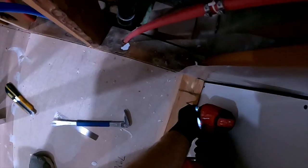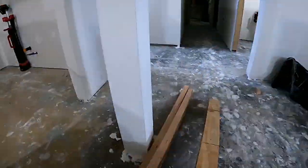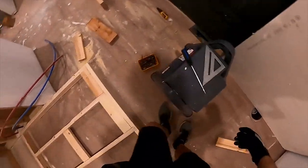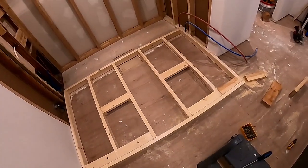I can get one screw in here and then fuss the other end, and then we can check the middle — but these are straight, it should be good. I can't even feel a seam there. There's no rock here at all. This is the frame for the drop ceiling. I can screw straight back into the other framing, and then I added blocks in the front to be able to attach to the trusses through the drywall. The blocks in the middle are for holding the plumbing.